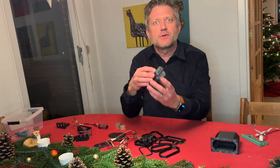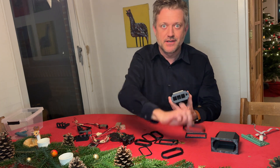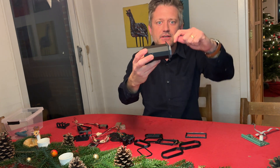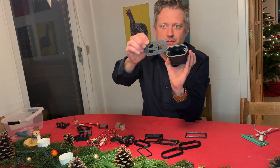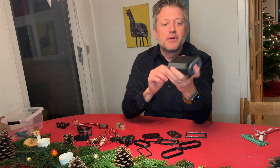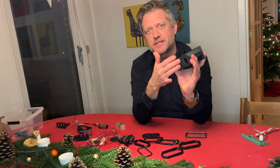That was the switches — now we have the housing. I needed to mount this housing inside the cockpit as well, so some sort of bracket. After prototyping the size and getting the right dimensions, I ended up with this housing that I can slide the panel into. There are about two millimeters of space where you can lean it against your panel. On the back I printed a piece that is fastened with two screws and has holes for two DB9 plugs and an extra hole for additional wires. There's no backlighting in this. With a few drilled holes, this will hold the entire unit in place, and I can have my DB9 plugs in the back going to my interface card.